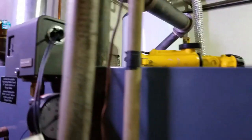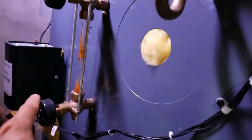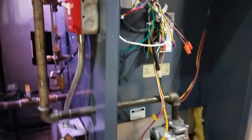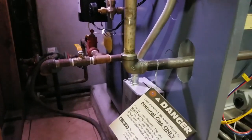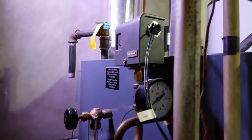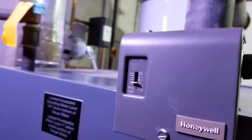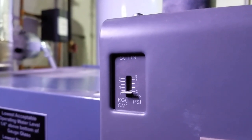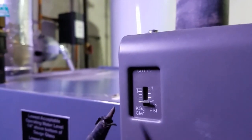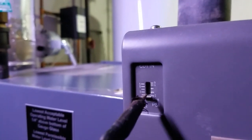This is the emergency switch — in case of emergency you can kill everything. This is the low water controller. After troubleshooting, I found that the cut-in switch had been adjusted very high, or someone forgot to adjust it. Usually the cut-in switch should be set to one and a half or two pounds (psi). I found it was set to about 8 psi, so I adjusted it down to 2 psi.